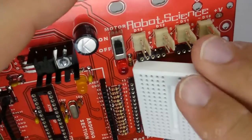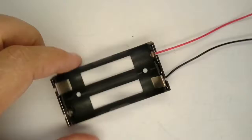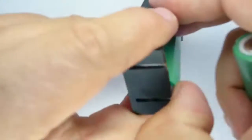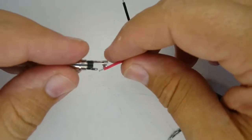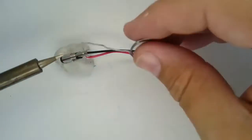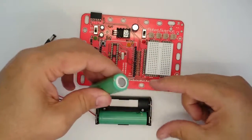The next item to mount on the Africabot Primo controller board is the mini breadboard, where you will make connections and put parts on the robot. Peel the backing off the mini breadboard and stick it in place in the designated area. Now go back to your kit of parts, find the battery holders, and connect an inline female DC plug to the wires. Make sure that the red wire is connected to the center pin, which is positive, of the inline female DC plug.